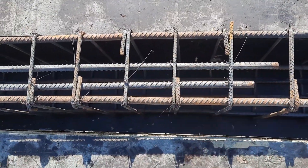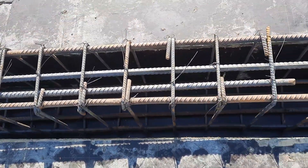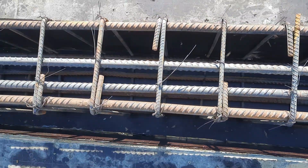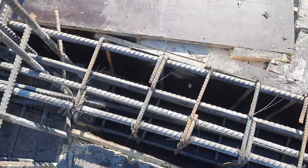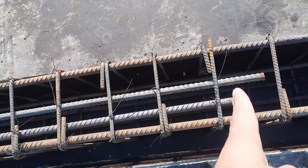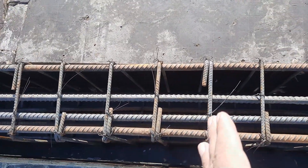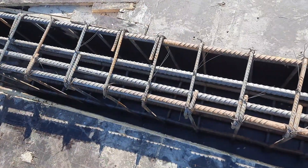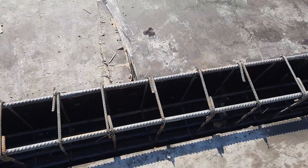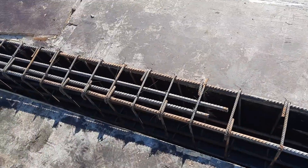The spacing is four inches at the distance of L by 4 and six inches after that. Hooks are bent at 90 degrees — if you are working on a construction site, be careful especially for these common issues. Concrete cover is also very important to provide at the bottom of this beam. They didn't provide it yet, but after completion they will. The concrete cover should be fixed with the steel reinforcement using binding wire. The minimum concrete cover should be 40 millimeters or 1.5 inches, especially for a commercial building, on the left side, right side, and bottom bar.